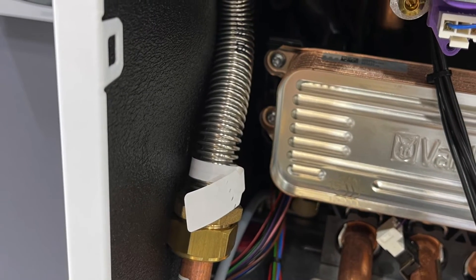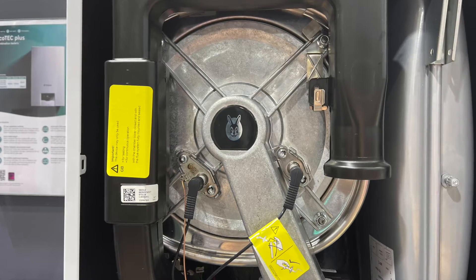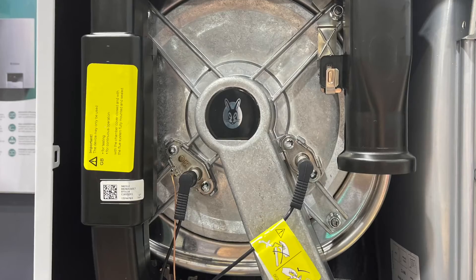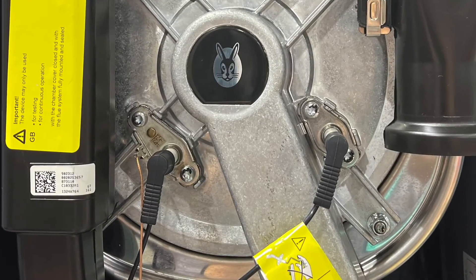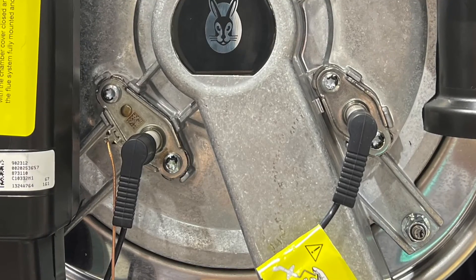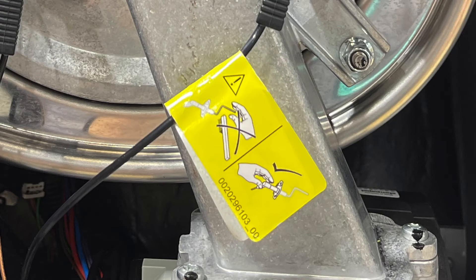We can also see the flexible stainless steel gas pipe going from the copper pipe to the gas valve, which looks slightly bigger than the old boiler. Looking at the burner, it pretty much looks like the old burner except for the logo in the middle, but there are now two electrode probes. The one on the left is still the same flame rectification and ignition probe, but the one on the right is an ionization probe. This probe gives the boiler — via the gas valve — an intelligent gas combustion monitoring system, helping the new EcoTech Plus reach a wider modulation range of up to 1:11 for even greater system efficiency. This also automatically gives you an LPG conversion on most of the boilers, which can be completed in minutes using the new interactive interface with no additional parts required.